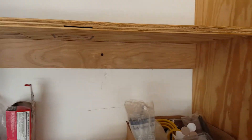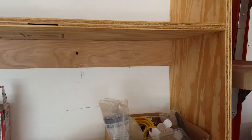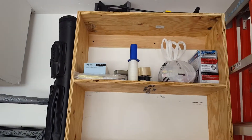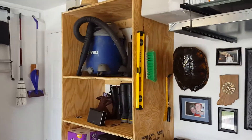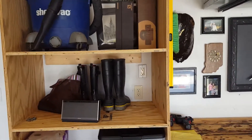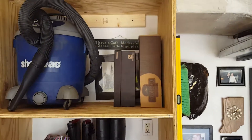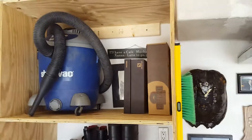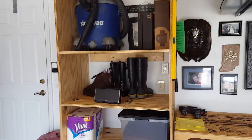I built this one second and added a little wall bracket, pocket holing it all to the sides and top. I like that better than how this other one looks. But this cabinet was so heavy I had to attach the two by four to the wall first and then set the shelf on it and screw it from the top. It's gonna work — it's big and holds my shop vac, rubber boots, and dog food.